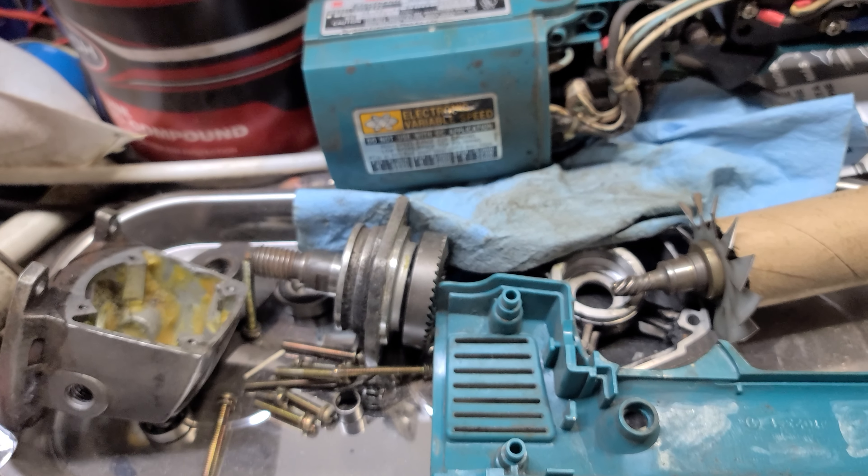I remembered that water jet, and I've seen them in the supply stores — they're like a wand, longer, probably made for going under driveways. That's just a narrow sidewalk, but that thing worked pretty good — better than getting the Makita and trying to cut it with a six or eight inch concrete or brick cutting blade, which I think would have taken a lot longer. For this video: if you're thinking about going under a sidewalk, you might want to pick up one of those things instead of cutting through. They do work — I was skeptical — and it went through almost exactly where I wanted it to come out. It started squirting out the other side right where I wanted. Oh cool, it's going the way it should.